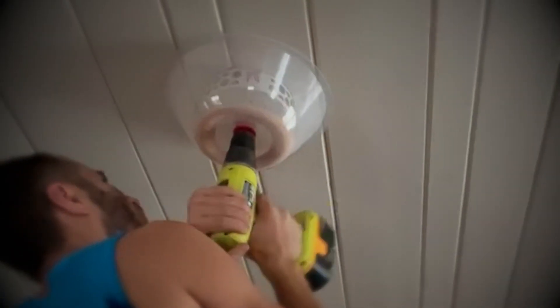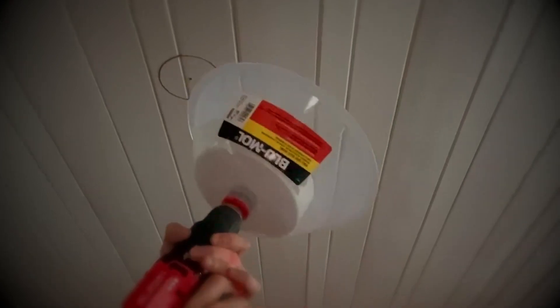If you drill holes through wooden planks, you're going to need a better drill than a regular cheap one, and preferably an impact driver, since it's difficult for the high number of hole saw teeth to penetrate into the wood without a powerful mechanical force behind it.